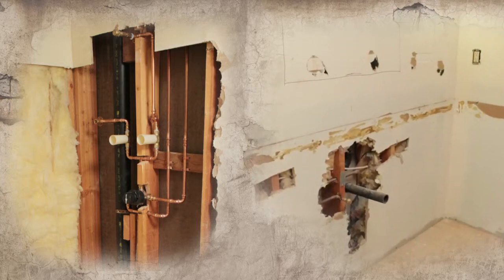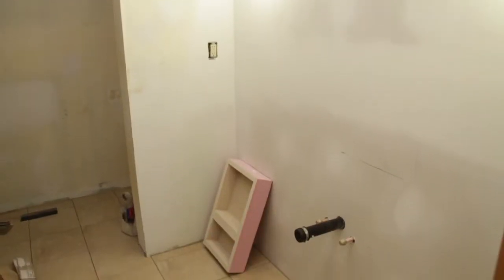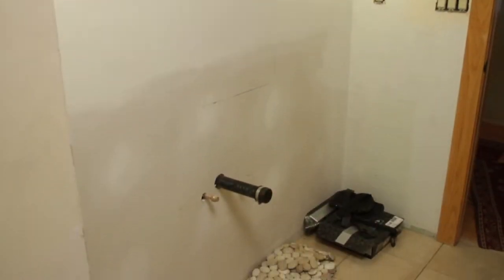On the right-hand side, because we're getting rid of that long vanity cabinet, we're putting in a freestanding cabinet. We've shortened the drain and water piping and lowered them to accommodate an undermount sink instead of the drop-in sink that was in the earlier photos.